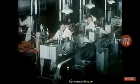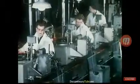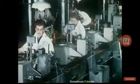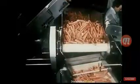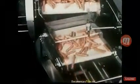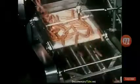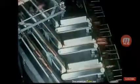The wieners are now lifted from the chain and placed on supply tables for the stripping machine operators. This is where the artificial casings are removed. Skinless Hormel wieners leave the stripping machines and fall onto a conveyor belt system. The wieners are next discharged onto a much wider conveyor belt for even distribution to 4 high-speed takeaway belts. The wieners hurry to a slotted stainless steel belt where free-swinging deflectors arrange them into a single layer.